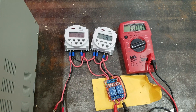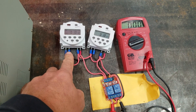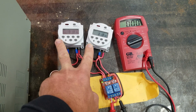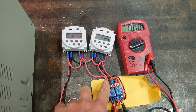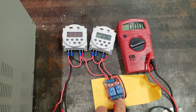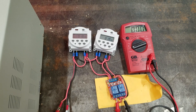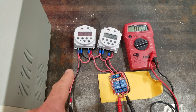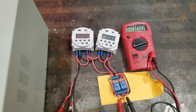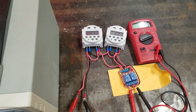And then same thing with ground. Instead of daisy-chaining ground, the straight ground needs to be here, here — or again, if you have the newer timers, that might be switched those two. Ground needs to go here, down here, and down there. So you could run individual wires to all those points rather than daisy-chaining them like I have. It's just personal preference. Alright, good luck.